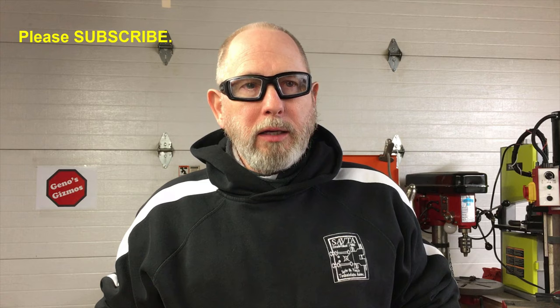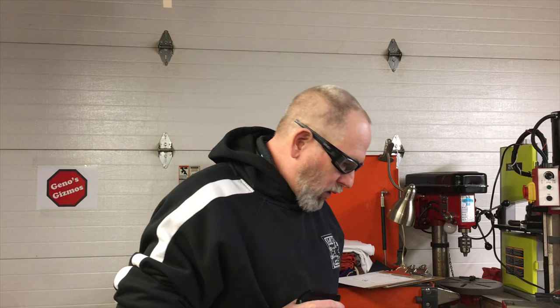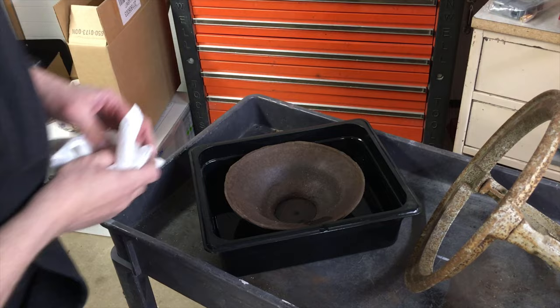Welcome back. It's been a week since I started this project. I did sandblasting — that took forever. I'm going to try something different: I'm going to use Rust-Oleum rust dissolver. This is the gel version. You're supposed to dampen whatever you're working on, then squirt it down. The other day I just squirted a little bit on it with no prep — it did absolutely no good, but it seems to have sealed the rust in. So I'm going to get it wet and soak it a little, then hit it with this stuff and see if it breaks that rust up.